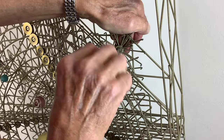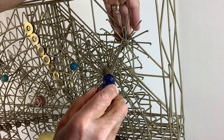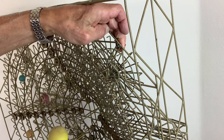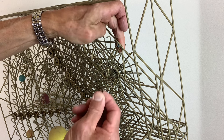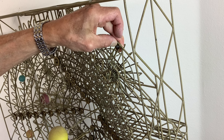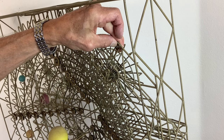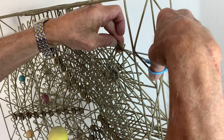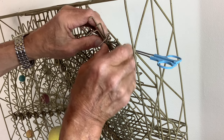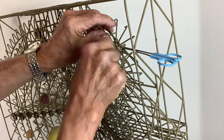The position of each rotating part is adjustable. The wire supports have either slots or U-loops at the attachment locations. A weld nut, which is shaped like a top hat, is placed on the back side of the slot. On the front side, a large and small washer are placed on the weld nut. This stack is temporarily held in place with a clamp. A 4-40 flathead screw is passed through the bearing and screwed into the weld nut. After adjustment, the screw is tightened to fix the position.